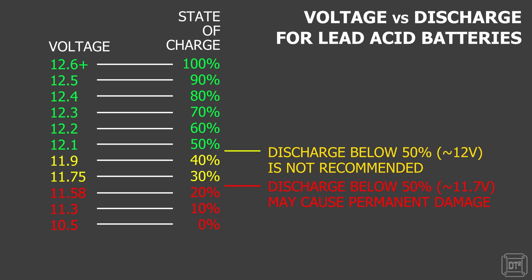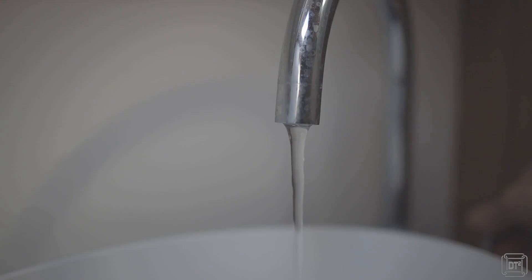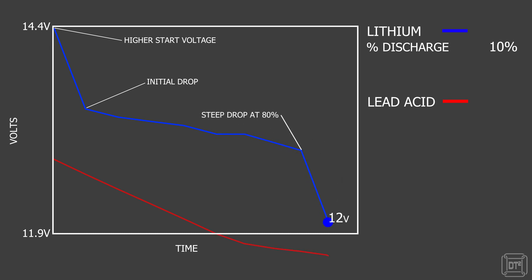The other significant difference between lithium and lead-acid is the voltage delivered. A lead-acid battery voltage will slowly drop over time, which gives an indication of remaining capacity but can cause issues when powering devices that require the higher full voltage — we have all experienced slightly dimmer lights or slow water pumps when the battery is getting low. Lithium batteries will deliver at or close to their designed maximum voltage all the way up to 80 or even 90% discharge, at which point the voltage drops quickly and the built-in management circuits will turn it off altogether to protect the battery. This is why lithiums tend to deliver closer to the stated capacity, whilst lead-acids suffer from insufficient voltage and potentially damaged batteries as they reach around 50% of remaining capacity.